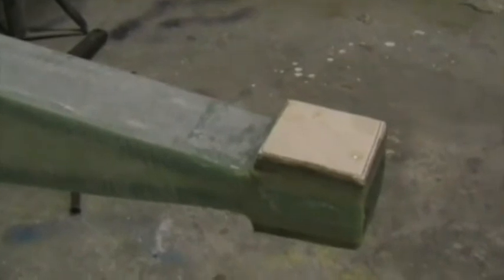And to determine this, I set up the wing with the correct dihedral. Here I've got the root resting on stands and the tip is 333mm higher. That's the leading edge. I set that up exactly and then I put on the carry through spar at the center and made it absolutely level. And then I looked in from the one end and measured that we came out to approximately 18mm at the top and 12mm at the bottom.